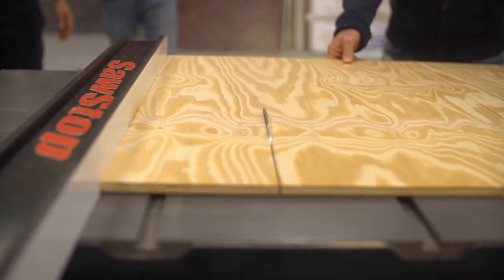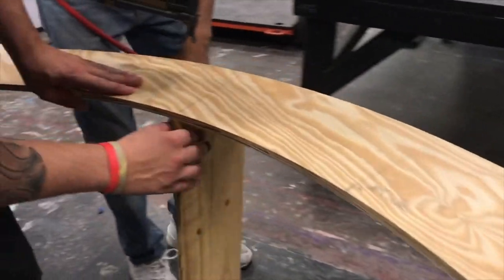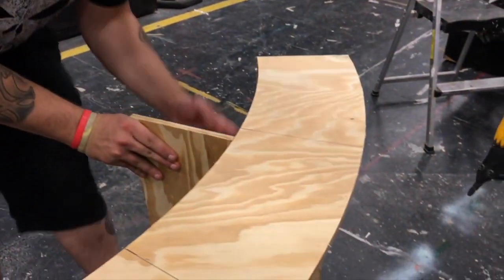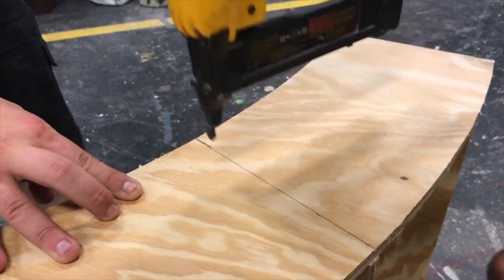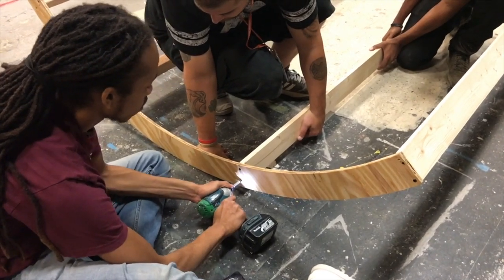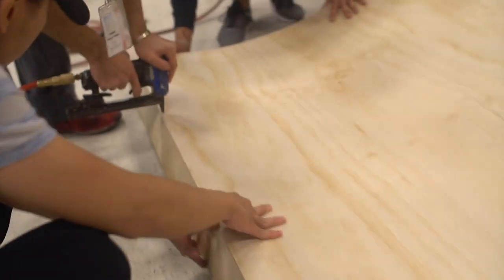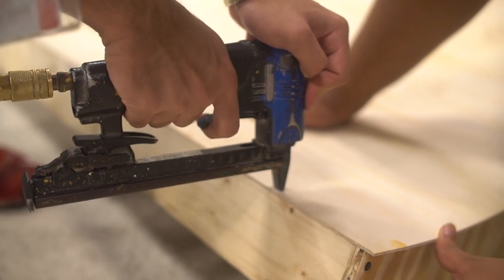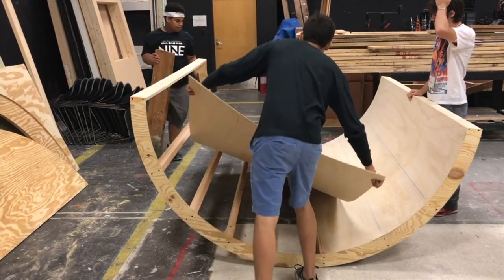We're just going to run it on our panel saw, run it on our table saw. We cut those the same width as the arcs, and then we're just lining them up. I think we used half inch or five-eighths inch plywood for this, and we marked them about a foot apart — it's not really important how far apart they are. We used inch and a quarter staples on that. Meanwhile we got another crew that cut out a couple of different arcs — much thinner arcs for the lower portions of the well or the interior portions. We did the same thing, cut the arcs, but instead of pieces of plywood as the legs in between, we used 1x4s and screwed them together, then laid eighth inch plywood on top of the arc once it was all together.